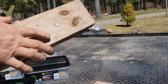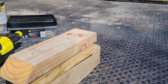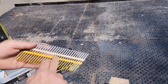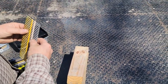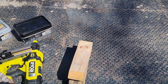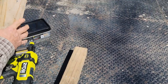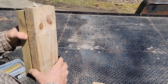I like that — that's a lot of power, guys. A little piece of plastic — plastic collated. I should have brought out some of the Stanley Bostitch — they're put together with metal wire, called welded. The only problem is occasionally it'll cut your finger because the nail has a little tiny barb. So maybe I'll like these better. I'm just not much of a pollutant kind of guy — I don't want the plastic laying around. Because these are ring shank, you're gonna need a good pry bar to get them apart.